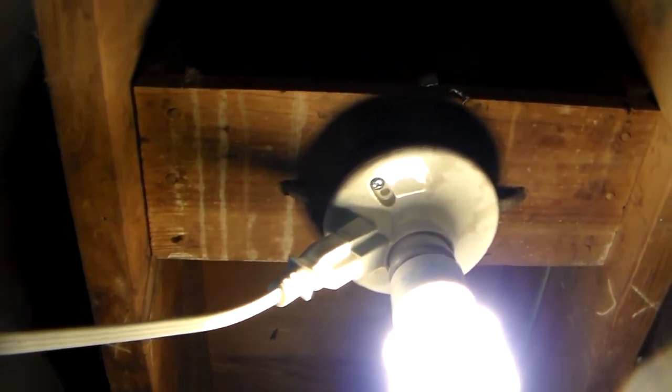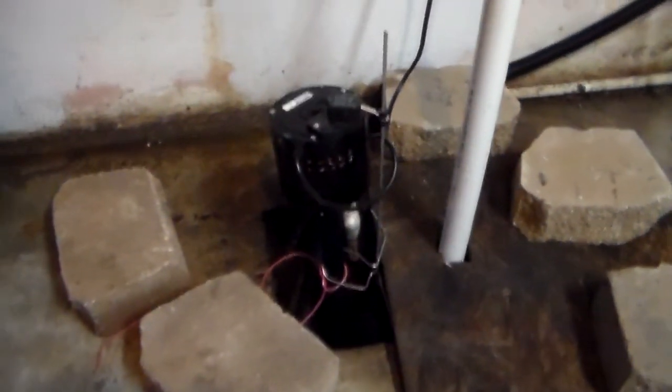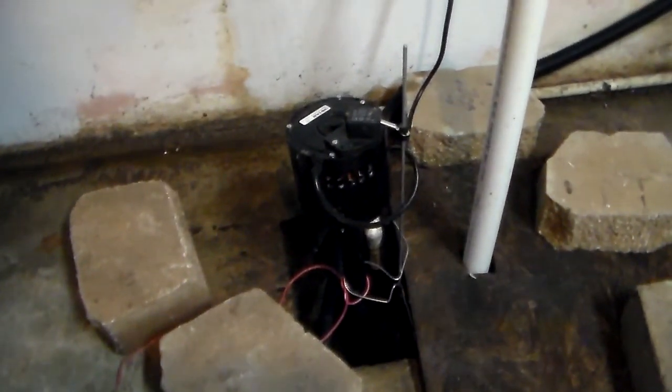So we're going to have to rewire that and put a box in. And there's no drain for the washer itself — it drains into this sump pump pit, and that pumps out through this hose through this hole in the window where there's a piece of wood, right out into the backyard. So that's unacceptable — we'll just have a big wet spot out there.